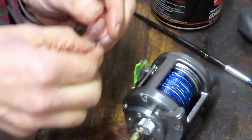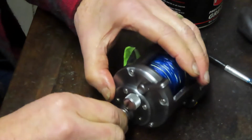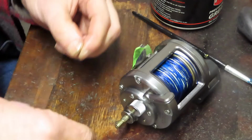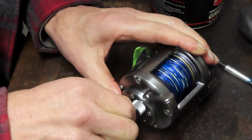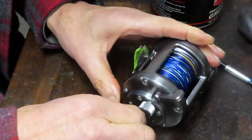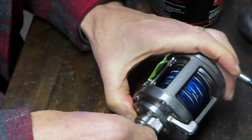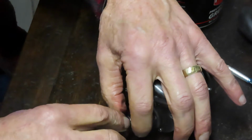All right, we had those two bell washers. I'm going to set them face to face. That's kind of like the medium piece for the sensitivity. And now for the part that everybody dreads, at least I dread, it's this crazy little rocket spring here. I'll show you how the factory recommends that you set it. There's two ways. One of them is with putting this spring-loaded device in here and trapping it with the top washer, which is what the factory recommends. The other way is to hold that spring compressed with a toothpick through the hole in the top. And I don't like either way. I kind of get a little nervous both ways.